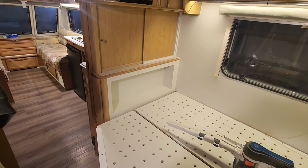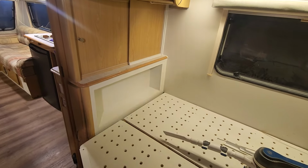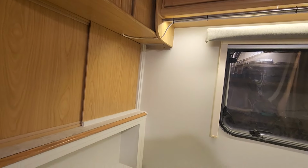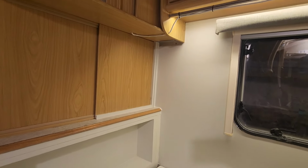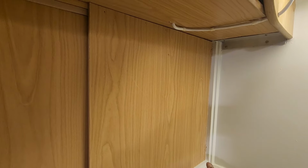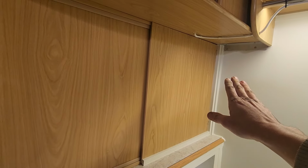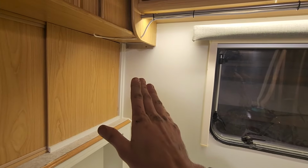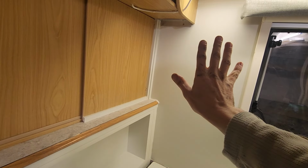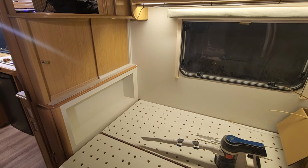Now, moving right along to the bedroom, once again, another load of work's been done. As I said in my last video, I will have to touch this in after fitting the alloy trim up there and fitting this wooden foot box or footwell. So I made this wooden trim, which wasn't as straightforward as it looks. I routed this edge to give it a nice feature, sanded it all and painted it to match the wall, and then ended up having to repaint this whole wall, because same paint but different pots at different times, the trim wouldn't match. It was a lot greyer, so I bought a new pot of paint and repainted this whole wall, and now it all matches nicely. Surprisingly though, the footwell seemed to match, so I left that alone.